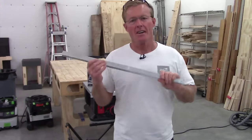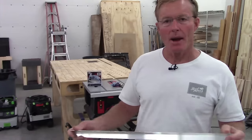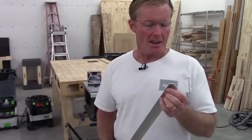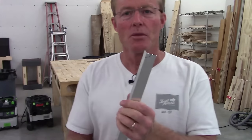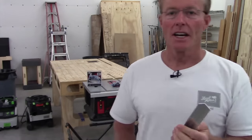What was most amazing was I had a few pieces of aluminum around the shop — I'd cut this out of a longer piece. I was looking for the cut that I made and I grabbed the piece I knew it was and I couldn't find it. I grabbed another one and couldn't find it either, until I realized yeah, this was the one. I started looking around and found it — it was such a small nick. I put a mark with a marker around it so I wouldn't lose it. I don't know if the camera will pick this up, but there is a nick right there, and that's what tripped the saw. You can imagine if that was your hand — you'd probably have a dot of blood, but there's going to be very, very little damage.